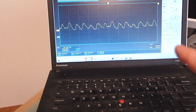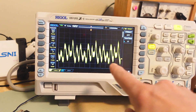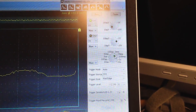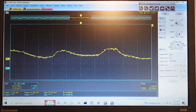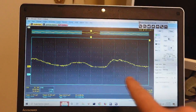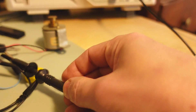Back to regular time-based mode - I've also got the USB scope hooked up, also in regular time-based mode, and it's updating the screen about twice per second, whereas this thing is updating far faster. Actually, that's limited by how long it takes to get a trace, so if I have a shorter thing on the screen it updates much, much faster. On the USB scope I'm going for this awkward little button to make the time base a bit shorter, and there seems to be a lot of high bandwidth transients in there as well.